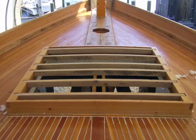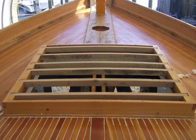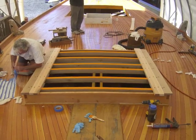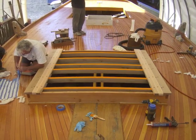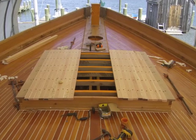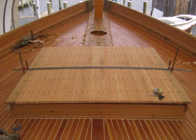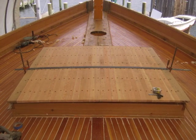In this image, the curve has been cut in the tops of the hatch beams with the ship saw. The decking strakes are applied and fastened with two-and-a-half-inch stainless steel screws. Wider oak strakes, or bread boards, are used at the high-wear sides, or the outer edges, of the hatch.